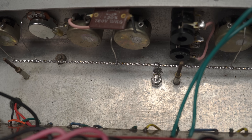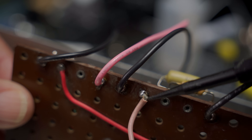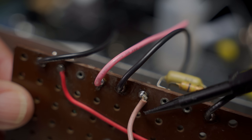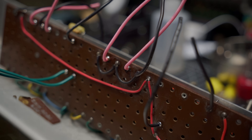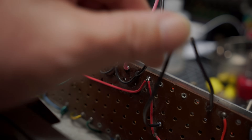I did some new 20-gauge bus wire from each pot connection to the bus wire, which reinforces everything and holds it in place. You can see it's got a new 1K linear tapered pot for the intensity on the tremolo. There's some new wire in place — that pink one I'm pointing out is the original wire. It was not really well sealed, and the strands are beginning to separate and they're corroded. That corrosion builds up and can make for bad solder joints. So I replaced the pink, the black, and some of the green wires with new topcoat wire of the correct size and color, to eliminate that as a problem in the behavior of the amp.